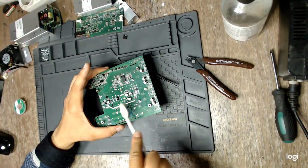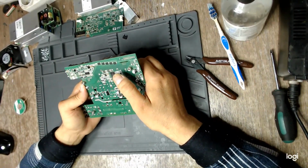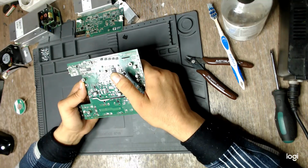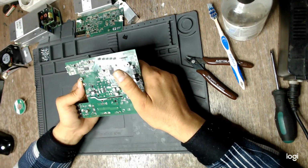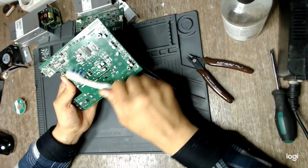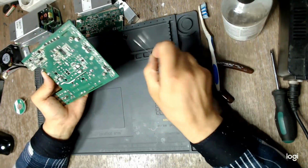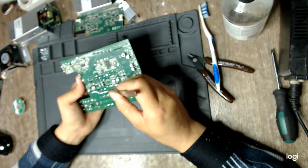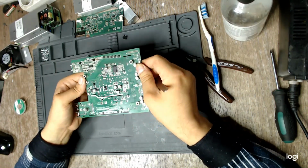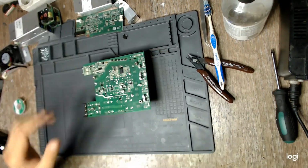I couldn't be sure if I hadn't received those spare parts from Tony, but I knew that any MOSFET does have a reverse body diode. It is part of the manufacturing process, so it can't be missing. And since such a higher forward voltage seems unlikely, I knew I had to be sure. So yeah, let's get the new driver in.